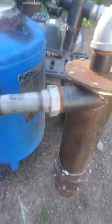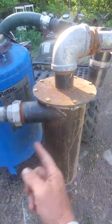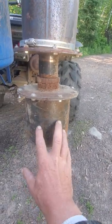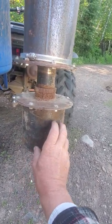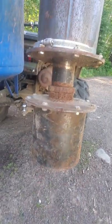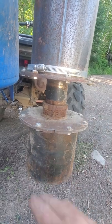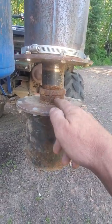As the gas and charcoal dust is coming through, it's going to spin around the whole thing. It's going to be cooling down, and as it's cooling down it condenses, and that condensate is going to settle in here along with some charcoal dust. So this is another thing that's really easy to make. You want this to be able to spin off, so you have to have threads here and another coupling.